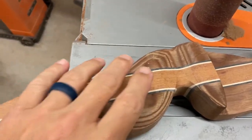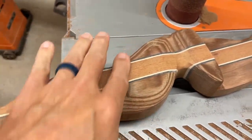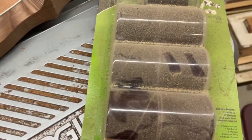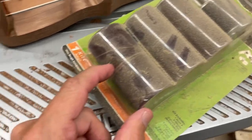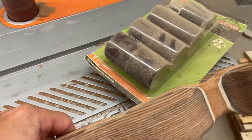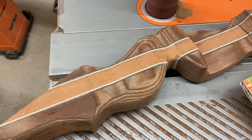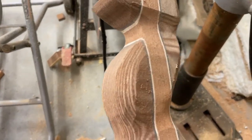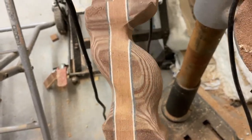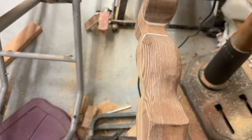I've been using 80 grit to kind of shape this but I've got a lot to take off in this handle area — I want to bring it in quite a bit right through here. So I'm going to switch to an old sanding drum that goes down to 50 grit and load it in my drill press. It's only about an inch and a half thick or so there, but I think I can put it on the drill press and work it around the grooves to get more of this off and get it closer to the shape I want before I start fine-tuning. Switching to that 50 grit is the right call — it's taking off material a little quicker than the 80 I was using.